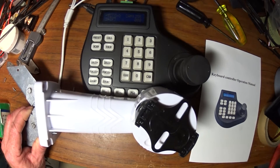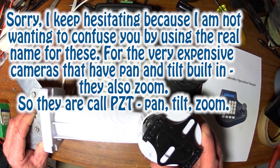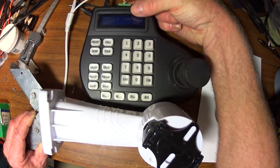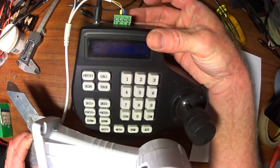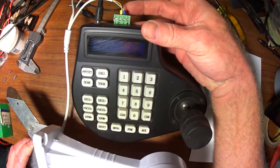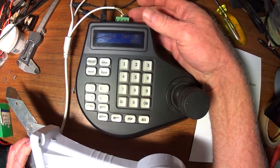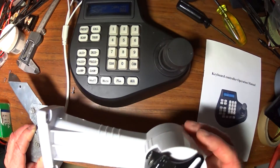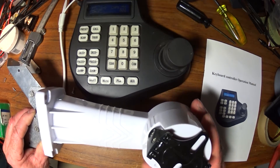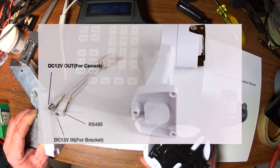The reason is that all these pan and tilts sit on the same communications bus — in this case, these two wires that come out the back of this handheld programming controller, normally blue and yellow. The blue is positive and yellow is minus, which is important to figure out when you hook all this up. That basically provides the signal, not the power. The power comes in on another connection, similar to your cameras, and you usually piggyback in on that with a split Y.